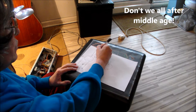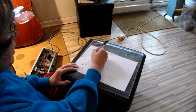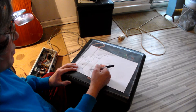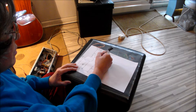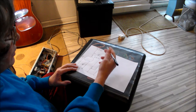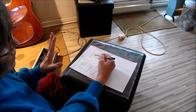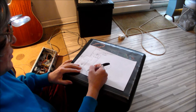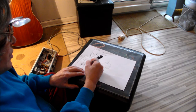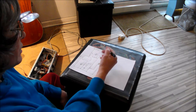Now in this particular instance we've got plus 271 volts sitting there. It's going through the resistor, which is about 100k, and this capacitor would normally stop any DC going through to this potentiometer. Because it's leaky, we're getting DC leaking past the capacitor, which should normally only allow AC to pass, the AC signal of the amplified guitar. It's not fully short circuit, it's leaky. Anyway, that's applying DC to this potentiometer, which is the volume. The tone control is also there somewhere. Looking at the schematic, you'll have a potentiometer and usually a capacitor there. So I suspect that this item here is the one that's faulty.